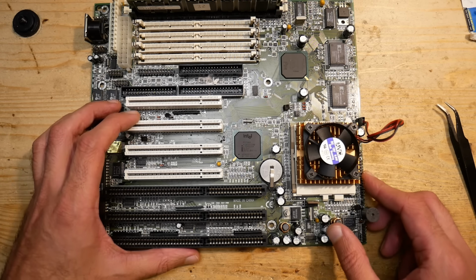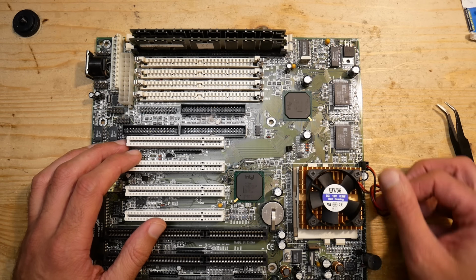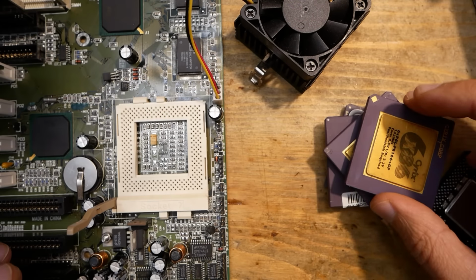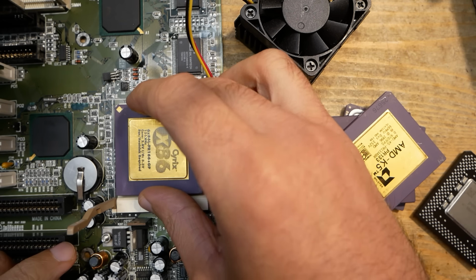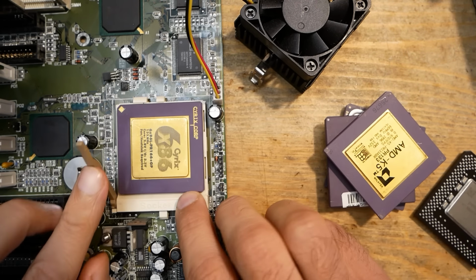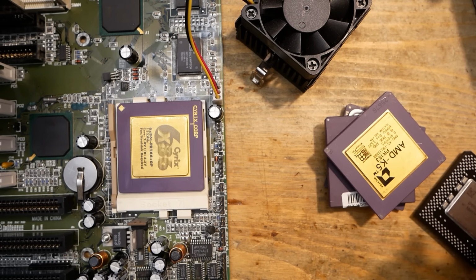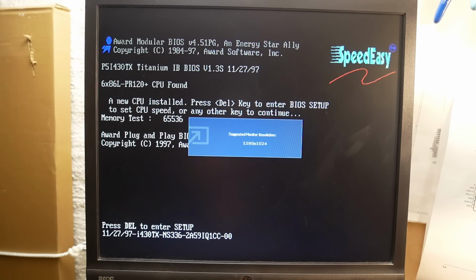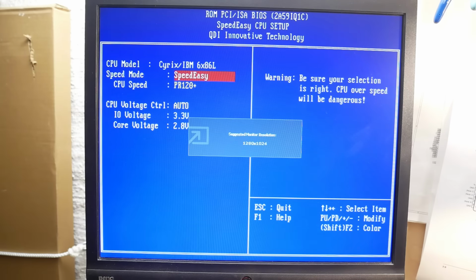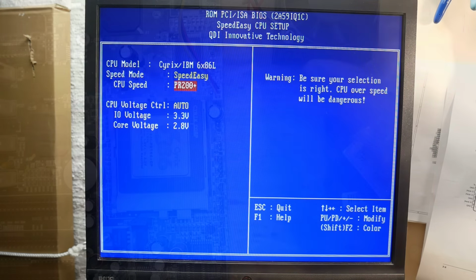However, for everything up to Pentium MMX 233, this board is awesome. Very high-end for its time, don't you think? It is especially handy if you need to test a bunch of different CPUs. Just drop those one after another into the socket and start the system. Have a dual voltage Cyrix 6x86L PR166? No problem, this mainboard detects it, sets the voltage properly and even allows you to overclock it if you want.